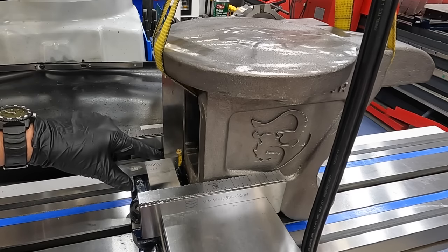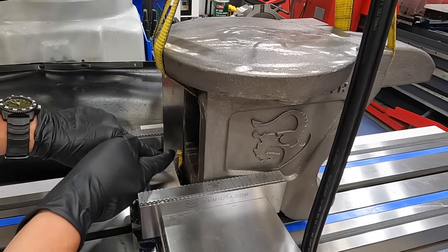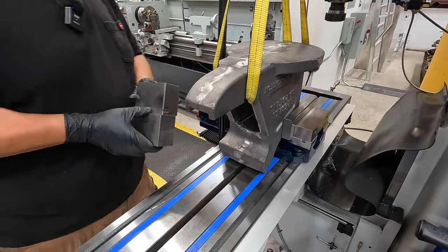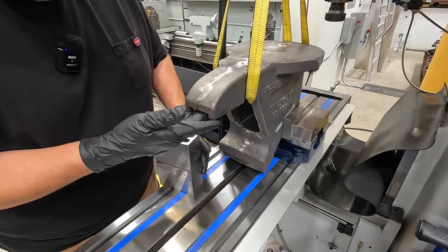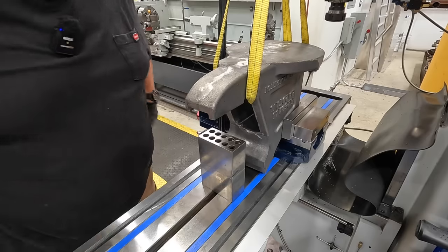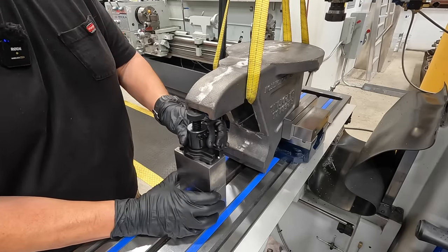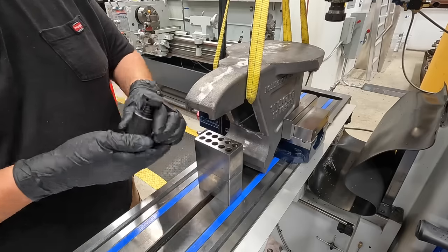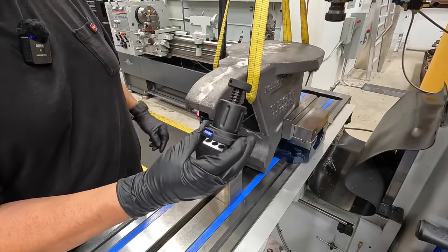We're definitely not square yet, but we need to finish getting it set up and getting it held in place so that we can adjust this thing around and then get this surface right there lined up with the machinist square. All right, we got a couple of blocks right here that we're gonna use for our stack up underneath the chin. Like that. And we're gonna use this machinist jack to support this side of the vise body. By the way, this is the new machinist jack that's offered by Edge Technology Products.